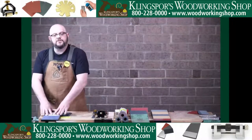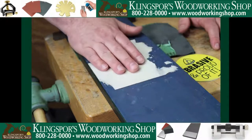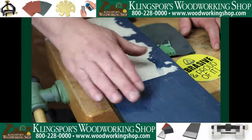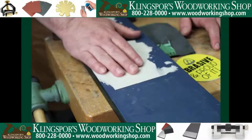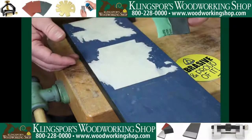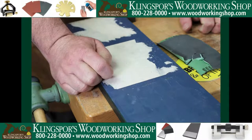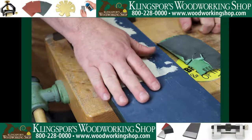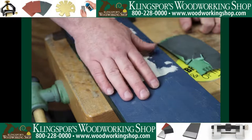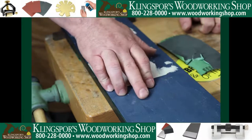Here are some pitfalls with using sandpaper as your surface: if you leave it on too long or it's overheated, you can see this is quite gummy. Mike, how long has this been on here? About five years. So five years of PSA adhesive stuck on a surface is going to be gummy. If you take it off and get nothing but glue left, most of the time because it's a paper product, you're going to be left with residue that's almost impossible to get off. There are ways around it — solvents like mineral spirits or acetone do work well. You can also use a heat gun to heat it back up and scrape it, but you'll still need some solvent for general cleaning.